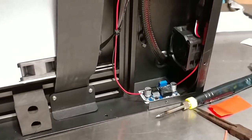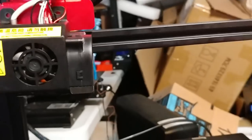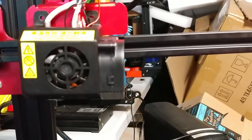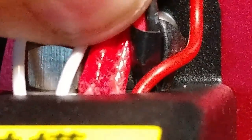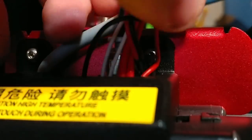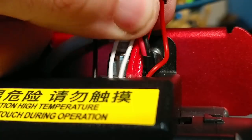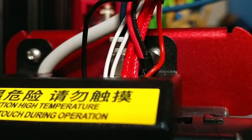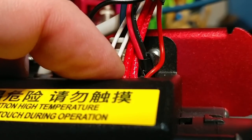Or nylon screws - I might do that too. I took the fan from the inside and put it on the outside so that should work, since it was working on the inside, which will bring my parts cooling back. But it wasn't the zip tie - it is the metal shell here. This metal edge here, as the head moves back and forth, it's rubbing against the metal and cutting into the heater cartridge wires.